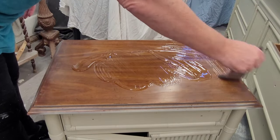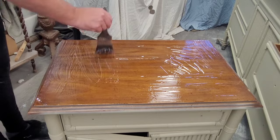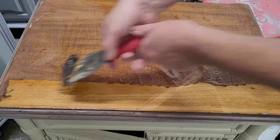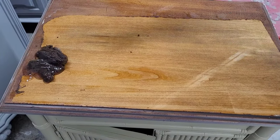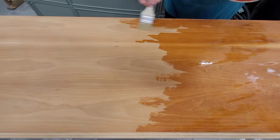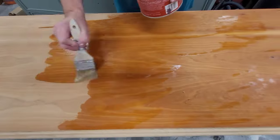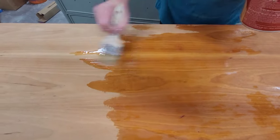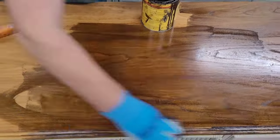I had something planned for the tops — I'm going to strip these back to raw wood. I'm using Green Ease stripper, which is a soybean oil-based stripper that is extremely effective for an eco-friendly stripper. I put this on the top of all three pieces, taking care since the bodies are already painted. After about 30 minutes I came back with a metal scraper and scraped off those old finishes to expose the really pretty wood underneath. With the original wood exposed, I sanded with my SurfPrep sander using 80, then 120, then 220 grit, and then applied an oil-based pre-stain conditioner from Minwax, massaging it in and wiping away the excess.